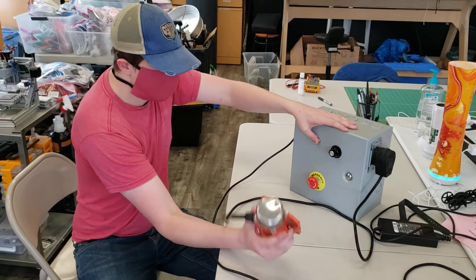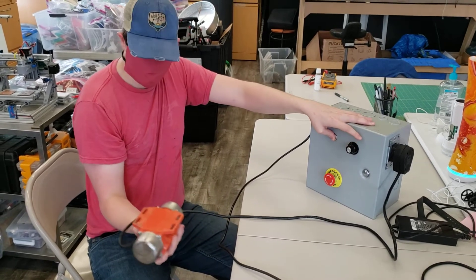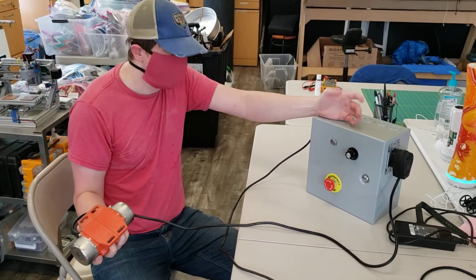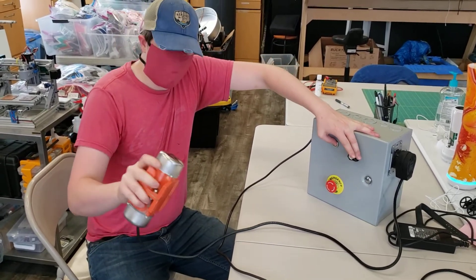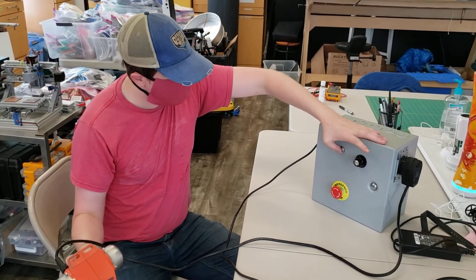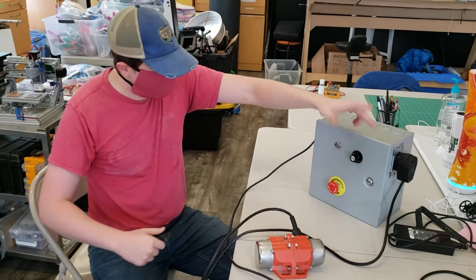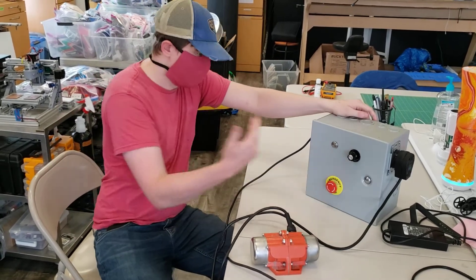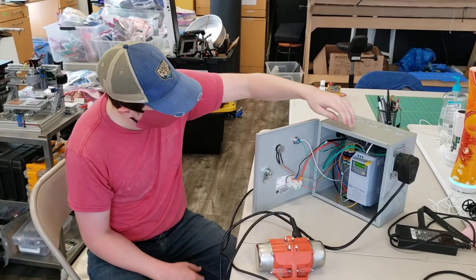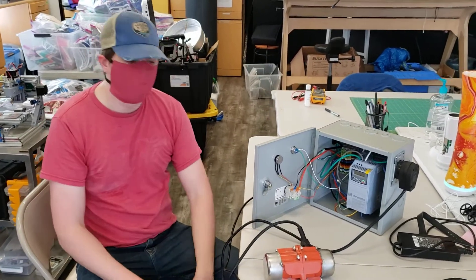So this is about as slow as it goes and it's not happy at all. Let's speed it up. I don't have it overdriving, but you can actually make it go faster than the rated speed — that's not something you want to do long term, so I didn't include the setting. I can turn it up, I can actually turn it down while it's still on. You could say this setting works for me and it just boots straight there and stops there — let go, stops. It's just marked 1 to 100. Each e-stop works exactly how you expect: you press the button, power goes away. The VFD takes a second to run out of power, but if you were outputting to this thing, then it immediately dies — there's no way it can sustain that off its internal capacitors.